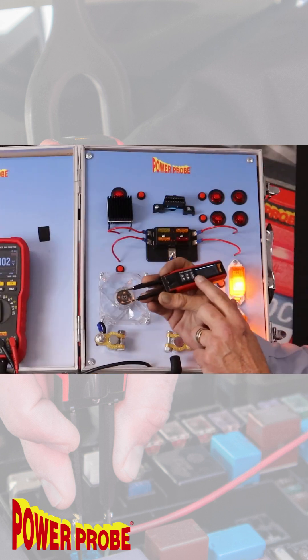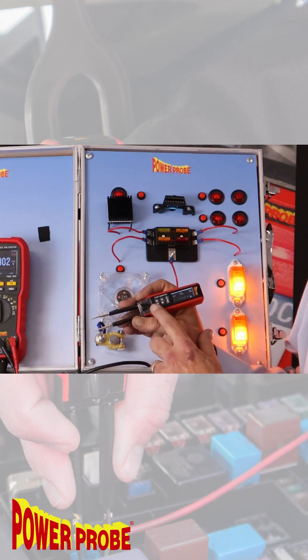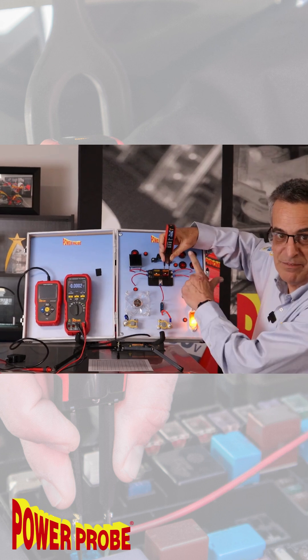When probing the fuses, use the mode button to select the fuse type, then the up and down arrows to select the fuse amp rating, then probe the fuse test points and observe the top of the fuse monitor.